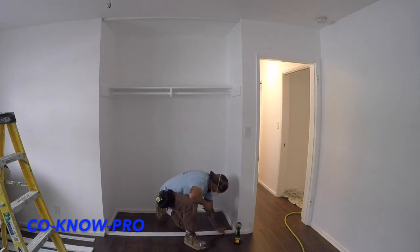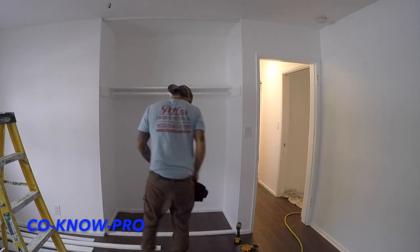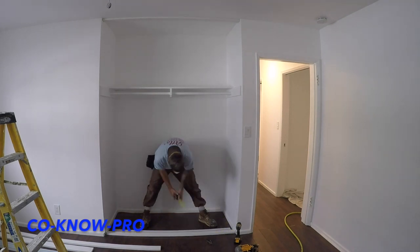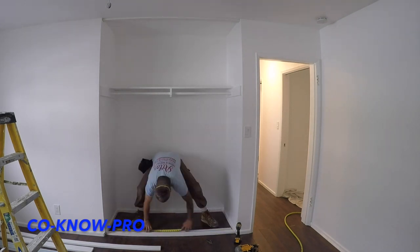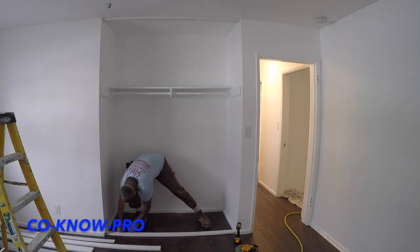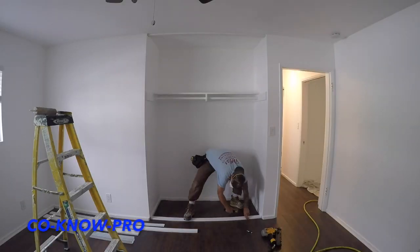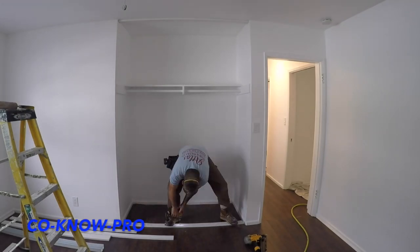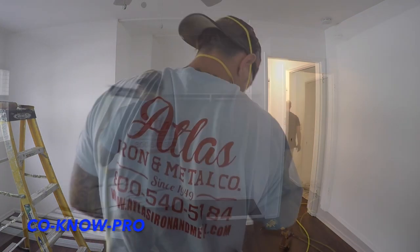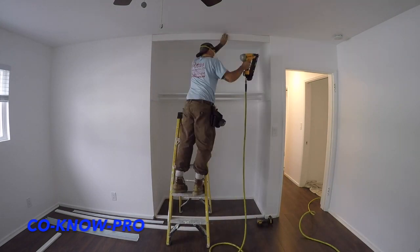There's my bottom piece. I'm using moisture-rated screws so that if any moisture from mopping or water gets under the bottom piece, those screws won't rust after about ten years. I countersunk and used a pilot bit, and now I'm sinking all my screws in for the bottom piece — that's the piece I'm going to set my track on. Same with the top piece.